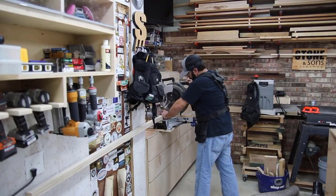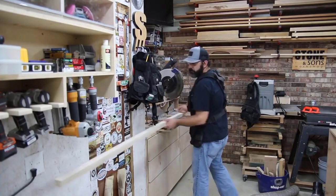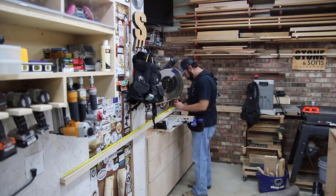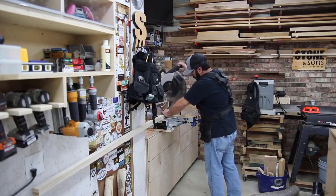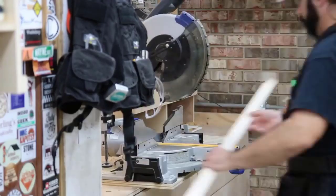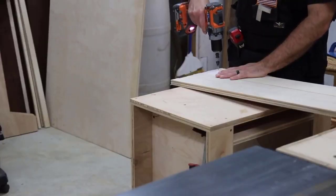With this particular style I'm making the four outside pieces — the two ends and the two sides — but there are also going to be some internal parts. I've already cut down strips of plywood on the table saw and I'm just cutting them to length here. This is going to create an internal section of the bed underneath for support, kind of like where the slats are going to go, but they're all going to be installed beforehand.